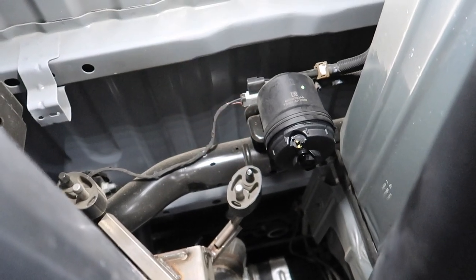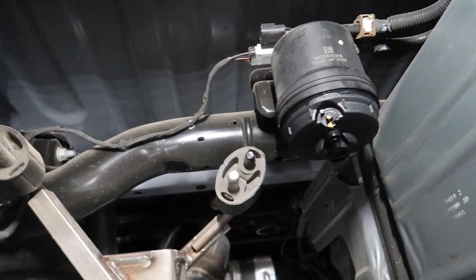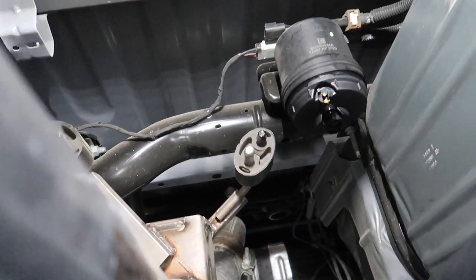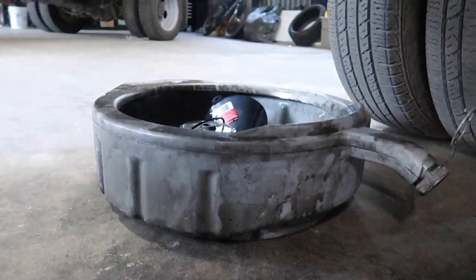Yeah, there's more room to work and stuff but the way it's designed... Alright, just finished up the fuel filters. The one in the engine is kind of located where you have to reach down into it to take it out — it's simple to do but not in the most accessible area. The other one on the bottom has a little drain thing which you have to open and it drains, but it's going to start falling on the drive shaft, so you gotta hold a funnel with a tube that goes into a drain pan. I used my oil pan — just drain it all in there.